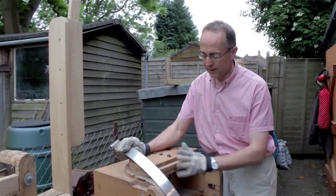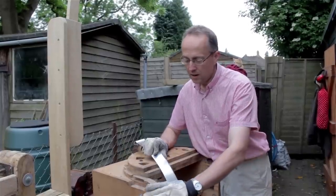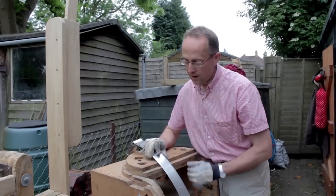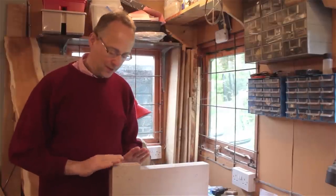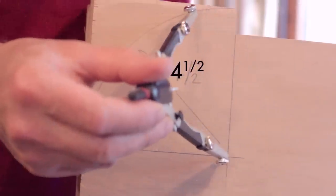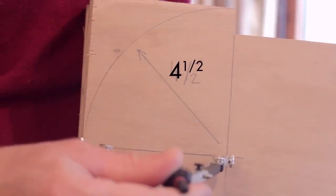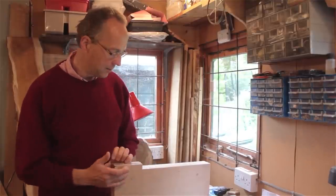The first job really is to cut out all these sections of wood and then start joining them all together using 18mm ply. Going to make the lower box section first, and then make the curved bits. I'm making the sides of the bending former at the moment — these are the bits that do the tight bend for the lower arms. I've got a four-and-a-half-inch radius to cut. I'm sandwiching three sheets of 18mm ply together to give a nice bit of landing space for the bent arm as it comes down — it's the tight radius bend.